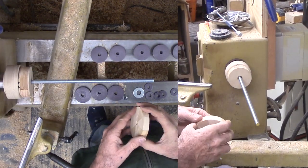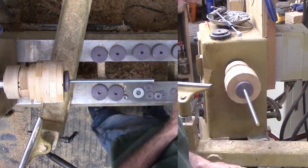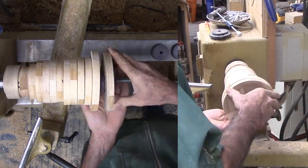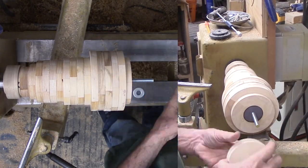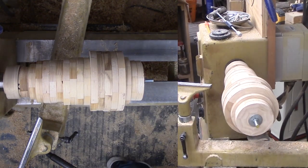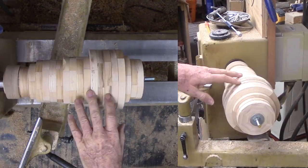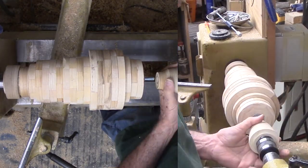I paired a faceplate with a 3/8 inch T-nut embedded in it. I also have a length of all-thread going through the T-nut. Excess rod is inside the spindle, and there is also a spacer on the outward side of the spindle to center the rod. Now I am stacking the segment rings onto the threaded rod. The rings with the larger center holes have a 2 inch spacer disc to keep them centered. No glue here — then add a washer and nut to the top to cinch up the stack. A faceplate on the revolving live center will keep the rod centered.